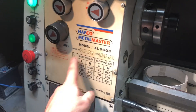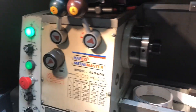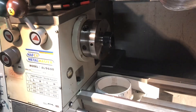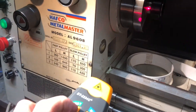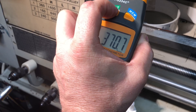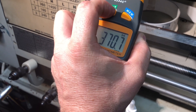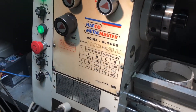If I go to my high pulley on my low reading, position one, I should be getting 360 RPM. My fast pulley is a fraction fast; my slow pulley is a bit slow. But it's within tolerance.